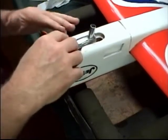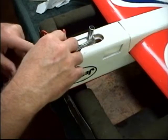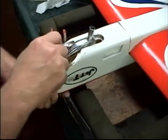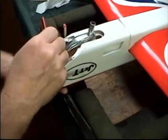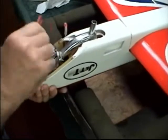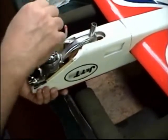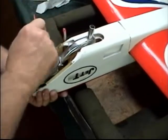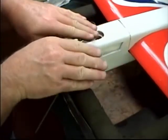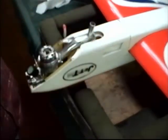And if we were going only on one, in other words, if you started adding washers under a bolt, you put 10 washers on a bolt, and no matter how tight you make it, it's going to loosen up. That's why I never use washers under bolts that I don't want to loosen up. Even lock washers, I don't use any. And it's the way it was explained to me, and I'm not so sure if it's totally correct, but it seems to work, is every time you add a clutch face, and as you add more and more clutch faces, no matter how tight you make it, they start to slip and loosen up.